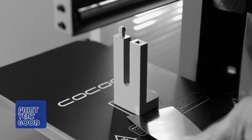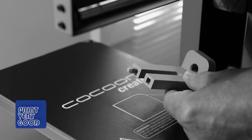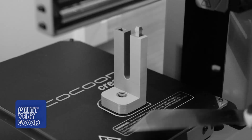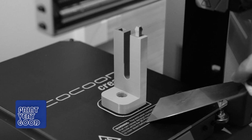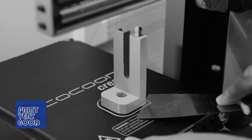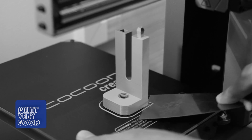And two, I want to keep it simple and quick to start prints. Just spray, level and print. So I've boiled down four main things that I do that may affect bed adhesion. Number one, setting the gap between the nozzle and the print bed to 0.08mm.